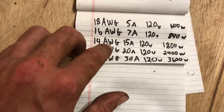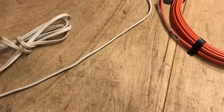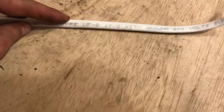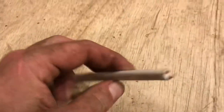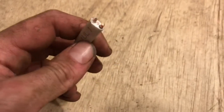For a 15 amp circuit, that would be 14 gauge wire. For 30 amp, that's 10 gauge wire. Here's some different wire to compare — this is 14 gauge, this is 12 gauge, and that's 10 gauge. If you look on the wire it'll say what gauge it is. Right here it says '12/2', which means 12 gauge, 2 wire. There are three wires in here, but the middle one is just the ground — you'll have a hot and a common in there.